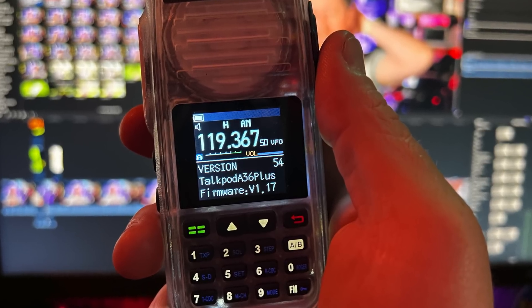$50 on Amazon. You can get this in clear, green, or black. This is a 2-meter and 70-centimeter transmitting radio. The one I bought off Amazon works just fine out of the box for ham radio and GMRS. I think when the sellers reached out to other reviewers, they got the version 1 firmware, which was locked to just GMRS. It's fixed now — I think this is running version 1.17. It is also a fairly wide-banded receiver. One thing this does that the Baofeng doesn't is AM airband receiving, which is super cool.